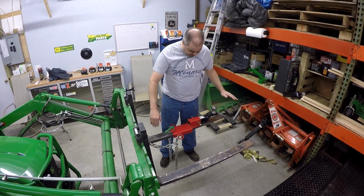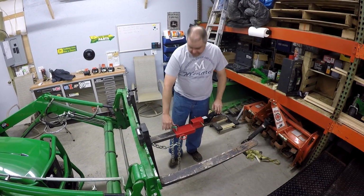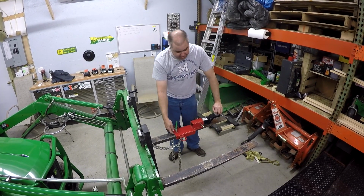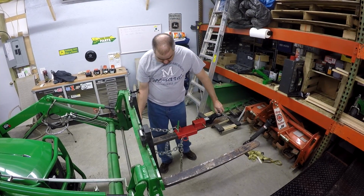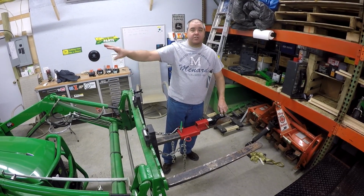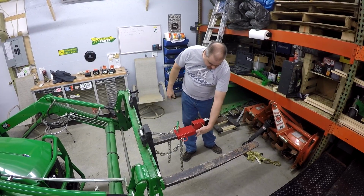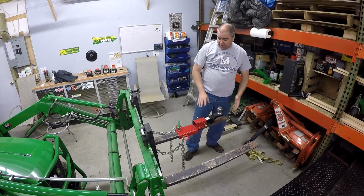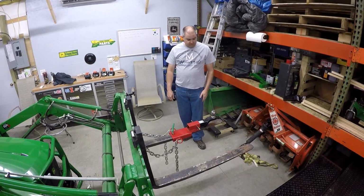I do. What's the negative? Well, how are you going to keep it from sliding either way? Exactly. This right here is just not going to be tight enough. I don't think I could put that tight enough to hold down there to be able to push the trailer. Now the chain, of course, prevents it from coming forward when you're going backward with the tractor, forward with the trailer. But the purpose of the original angle iron there and this nut after our approach was to keep it from sliding this way. And I just don't see that we have another solution there. So that's choice number one.